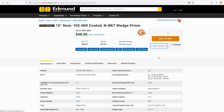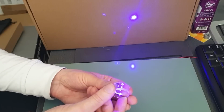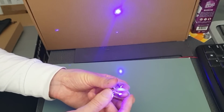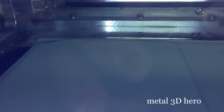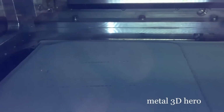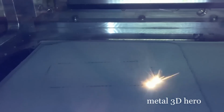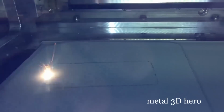The problem with this approach is that by the time you have bought 3 high quality prisms, you have spent close to 200 USD. And this still leaves you with minimal deflection. Furthermore, the reflection and distortion brought about by the offset faces of the prisms is particularly unattractive. Now I know everybody loves the effect of galvanometers, but at this point in time I don't think they are the right option. Because collimating this beam relies on a large degree of expansion, and most generic galvanometers have an aperture size of 10mm, unfortunately they aren't suitable.